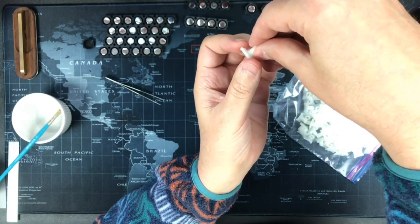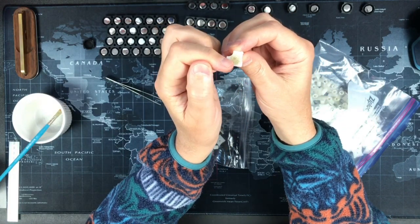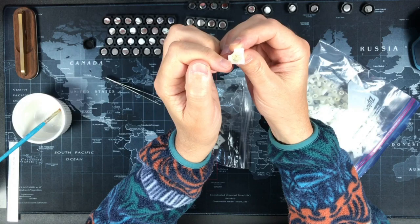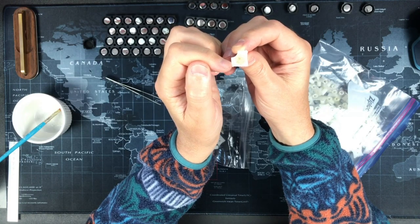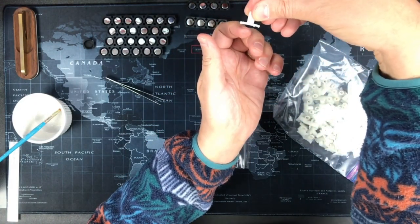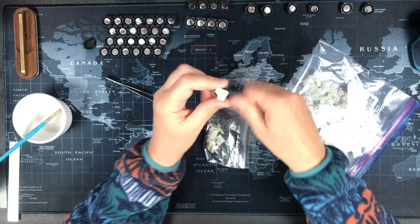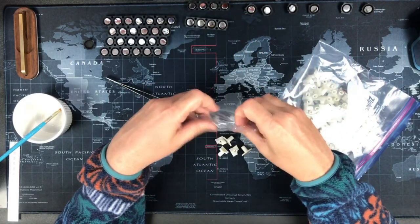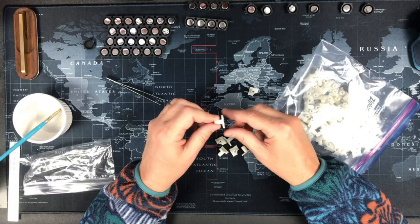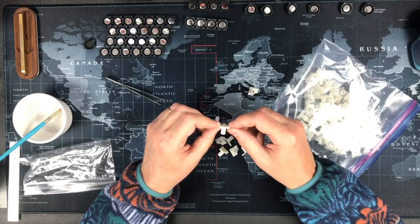And so they didn't have a rubber dome under them, they just had the foam and foil because of the spring. So this would be exactly how a Keytronic foam and foil board would work. The concept that keeps it from making the electrical connection is that the spring is holding it up, and you have to push past that spring to get it to touch the PCB. So there's this set of them that were that way, and they have some other traits, like the corners cut out, I think maybe they had to do that to achieve LED lighting or something, probably.